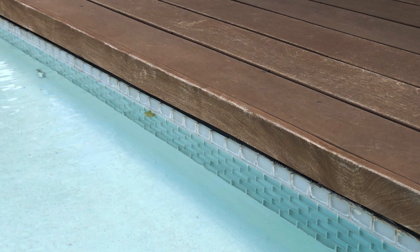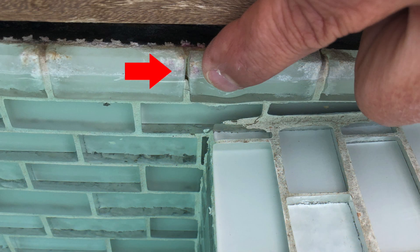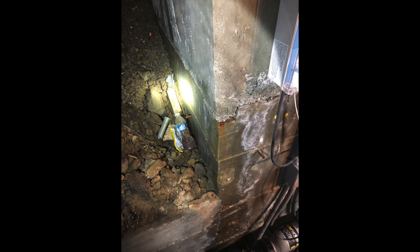When we get over here towards this lip, it looks like it might be a slot drain, but it's not. This water actually goes to waste and winds up underneath that deck until it drains away. But over here, we have a grout joint, and that grout joint is allowing water to get through there under the deck when the system is running. It wasn't designed right.